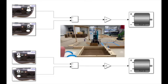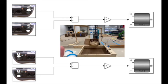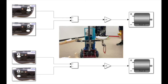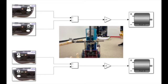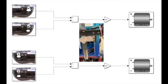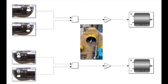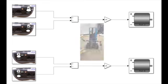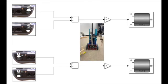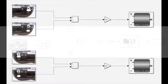To control the system, we have each of the 2 pairs of buttons send a value of 0 or 1. Buttons 5 and 6 up send values of 1 when pressed, and 5 and 6 down send values of -1 when pressed. Then the game blocks that we used multiply these values by 127, which is the full motor power in a direction, and the subsequent value is sent to the respective small motor, controlling one of the rack and pinions. We use Cortex ports 3 and 8 for our double rack and pinion system.